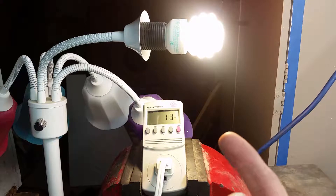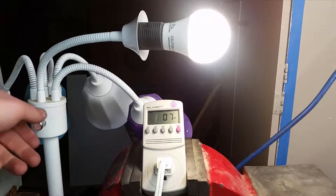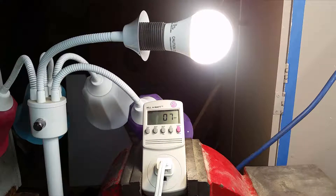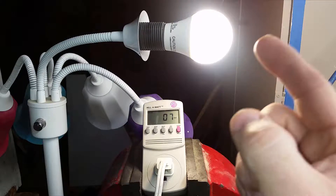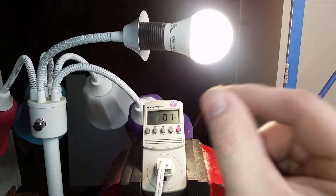Now we're going to move on to the LED. Instead of pulling down 13 watts like the fluorescent, we are now at 7 watts. These LED bulbs come on right away — full brightness immediately, no delay. They're cool to the touch. An incandescent has a life of 1,000 hours, fluorescent 10,000 hours, and these LED ones claim 25,000 hours. That's quite a bit of savings over time because you're saving on kilowatts and on how often you'll need to replace the bulb. I also love that they come on instantly and are nice and quiet.